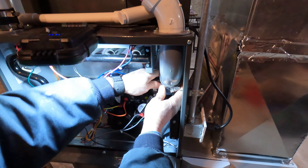Like I said, if you're having issues with E2, try this: loosen the screws up on the draft inducer, loosen this up and then pull it down — you just want to go down about an eighth of an inch or so, just enough to tilt it down to drain so everything drains and doesn't go back into the draft inducer. We'll see how that goes. I'll keep you guys updated if we have any more issues. If you got any value out of this, smash that thumbs up and we'll see you in the next one.